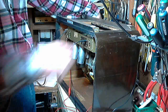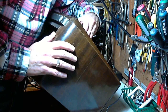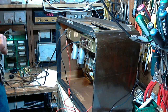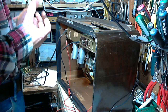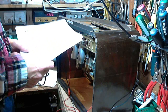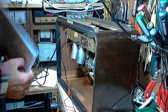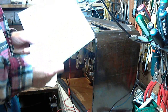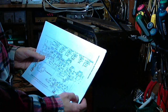Let's go back to the FM band. Back to the FM antenna. Not nearly as much AVC action here. You know, that's all kind of tying together - the detector discriminator, whatever you want to call it for FM, seems to be garbled. The AVC voltage that develops out of the discriminator seems to be weak and low. So I'm going to sit here quietly and stare at the schematic and ponder my next move for a little bit.